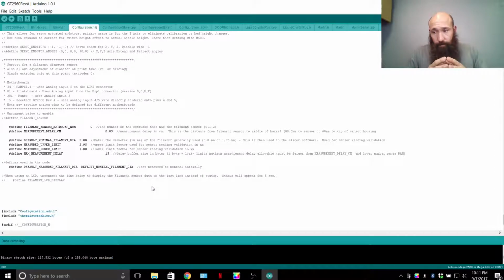Once you have that set up, what this essentially does is, if you're using it standalone with the multimeter and you push the button where there's a flashing LED on the board, if it's flashing, it's measuring via voltage. So voltage is a direct representation of the millimeters that it's measuring, in hundredths of a millimeter. It's accurate to within five hundredths of a millimeter, which is pretty good, darn good, considering that you're measuring via light and a shadow.